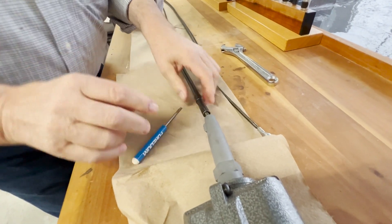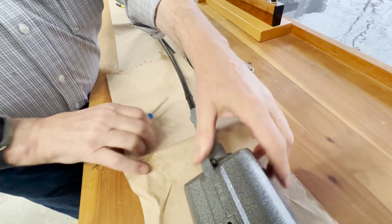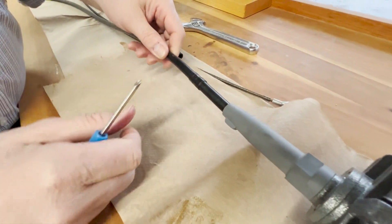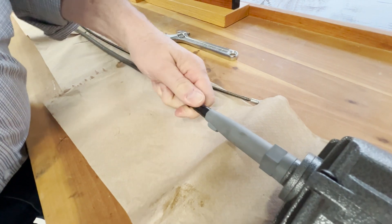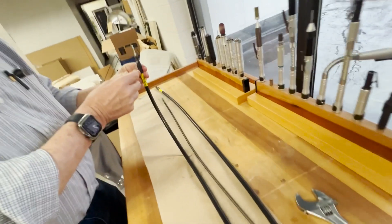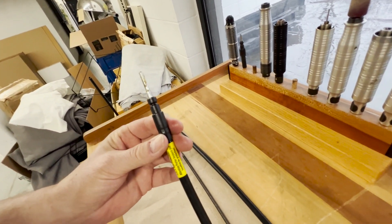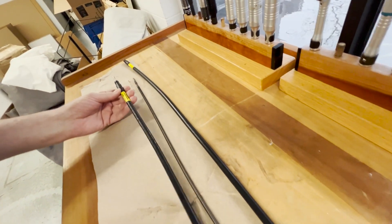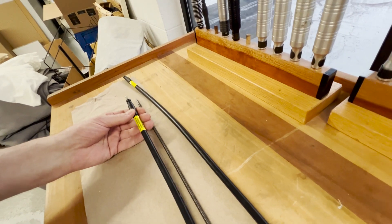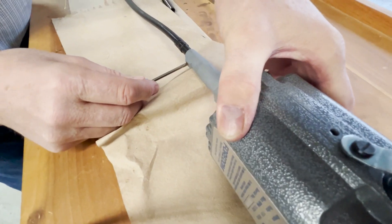What you want to do is adjust your sheath to your motor connector. You see that there's a large area here. You don't need to go all the way up to bottom it out because then your shaft will stick out too far. You only want it to stick out about three quarters of an inch. Slide that sheath down right about there and then tighten up the motor connector.